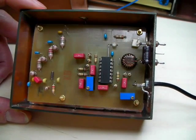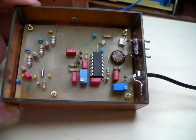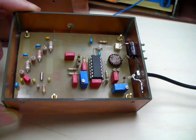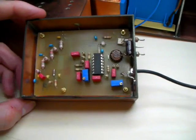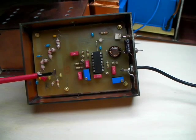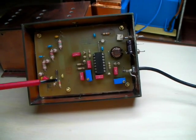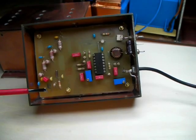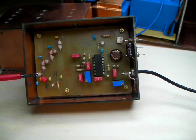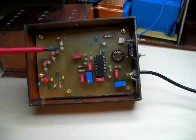The first module is the oscillator generating the 77.5 kHz signal and the level shifter. The part here is the oscillator — you can see the little crystal, and below the copper board there's the NAND circuit. Together it's a Pierce oscillator generating a square wave output signal, which is then filtered and converted to a sine wave by going through this Chebyshev low-pass filter.